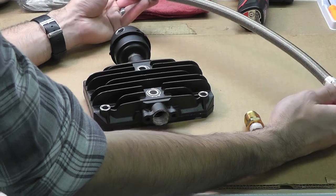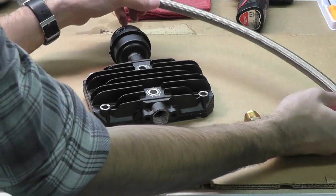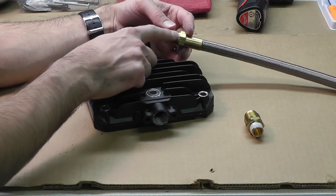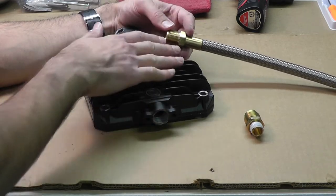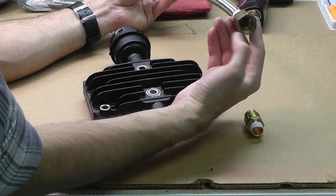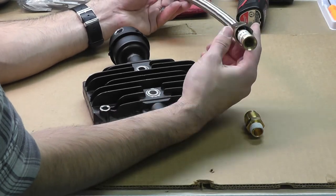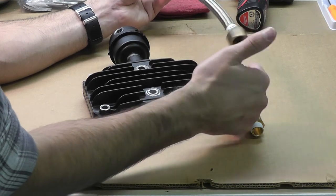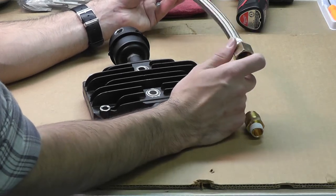Here we have a 1/2 inch diameter — it's our part number EMG-145C. It's a really standard, popular type because you have a 1/2 inch male pipe thread on the end that goes into your pump head discharge. On the outlet end going to your tank is a female flare swivel, which makes it a heck of a lot easier to install.